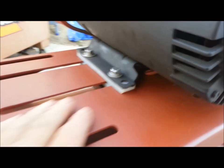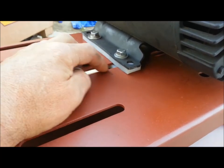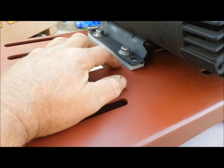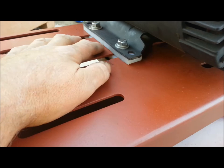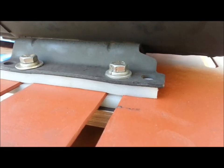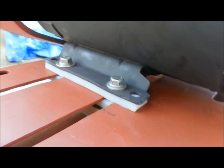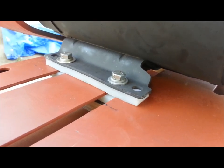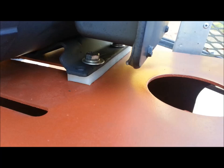The motor bolted directly down to this plate before - the top plate was actually cracked. We ground those cracks out, filled them with weld, and ground them flat again. Now I've sandwiched some UHMW in there - you can see where it's deformed to the slot. The bottom just has a threaded block that crushes the UHMW in there, so I'm hoping that keeps this plate from cracking again. It also gives you a nice slide across that top deck when you loosen those bolts.